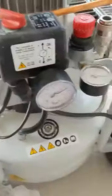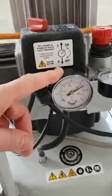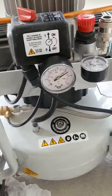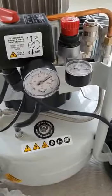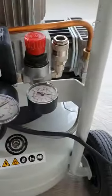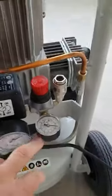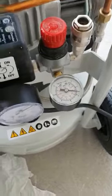So what we're now displaying with two gauges: the larger gauge is reading the pressure in the tank — similar on the C330 but you're reading the pressure in the three-litre chunky bar that goes round, which is also actually an air receiver. Next to that we have the regulator — pull it up to adjust, once you've got it press it down — and this has got a pressure reading which is then showing the outgoing pressure to feed the spray gun.